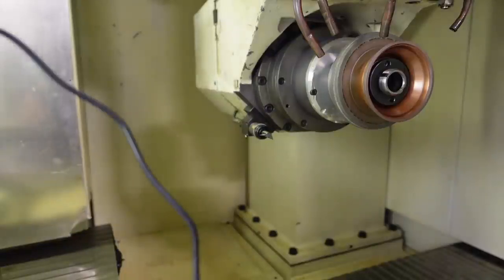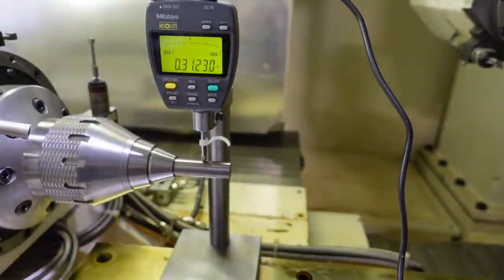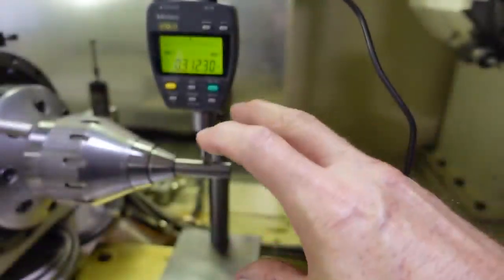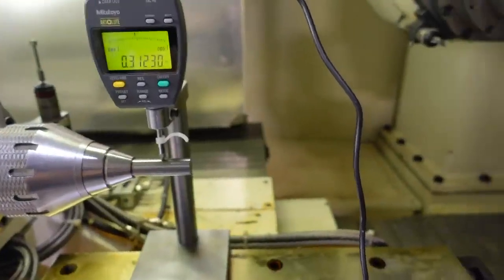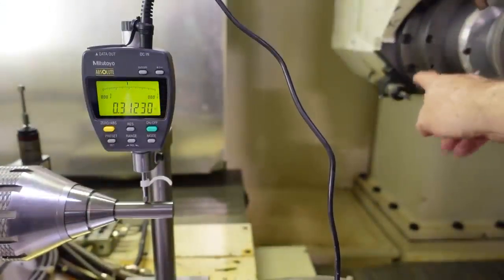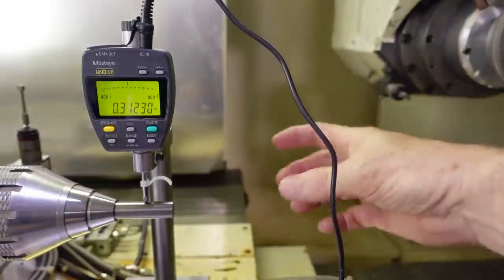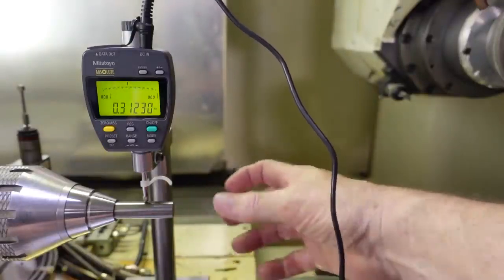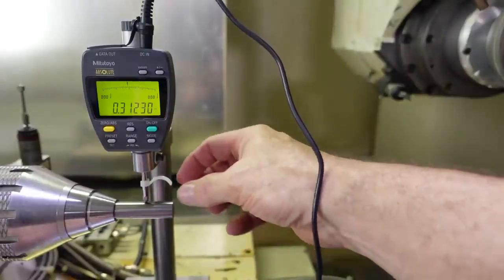it's kind of like you got to go back and forth with programs and everything, and it's just easier for me to do this, and with this indicator base, I get a real good visual of what the diameter actually is, and I can jog the tool back and forth on the flute to get the actual high spot, which, using the touch probe over there, theoretically it would be on the actual high spot of the flute, but I'm not really 100% confident with that, so I prefer this method, or to mic it with some mics. But if you have irregular spaced flutes on the tool, or an odd number of flutes that you don't have a mic for, like 7 flutes or 9 flutes or something, this is about the only way to do it.